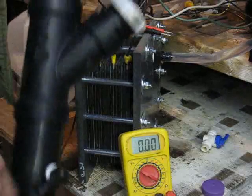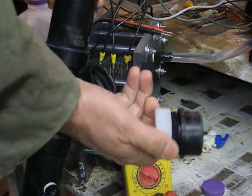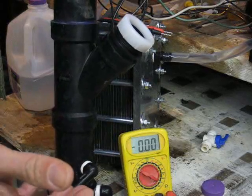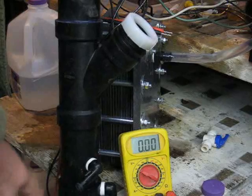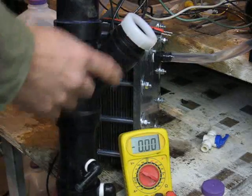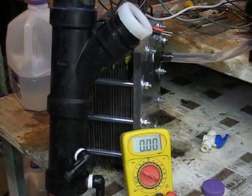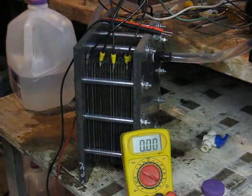Here's another observation. This is the bubbler I was using, and as you saw in the previous video it blew this fitting clear out — it's just a pressure fitting. If you look at this, it was sitting with this upward sweep, and since hydrogen is lighter than air it goes to the highest point, so I think I was storing some hydrogen in here. As soon as I got a spark I got an extra big bang, and it was unfortunately pointed very close to my ear. That gives me a nice easy fill place and blowout all in one, but I'm not sure that was the best idea pointed toward my working area.